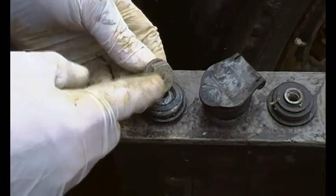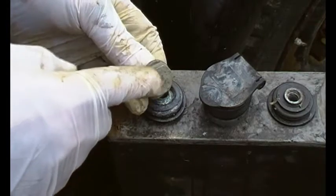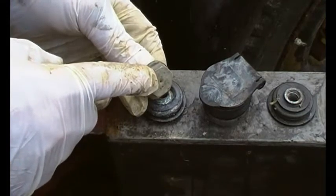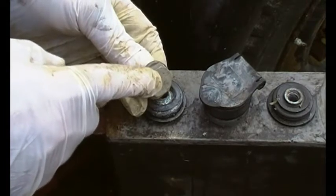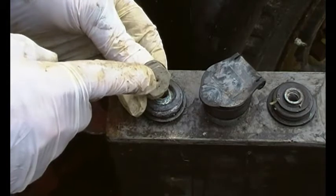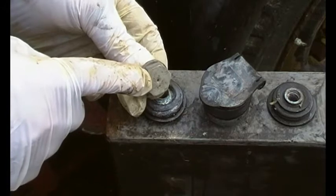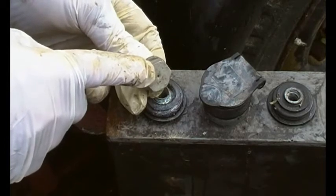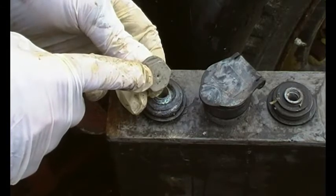The bolts can also suffer corrosion and the plastic breaks off. Sometimes you'll get a perfectly good pack of batteries where it's just the terminals causing the problem. If you recharge the batteries with proper links and pay attention to the low cells, you'll end up with quite a good battery pack for a wind and solar system - obviously it won't give full capacity for running a forklift, but wind and solar have different demands.